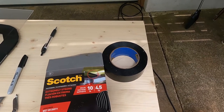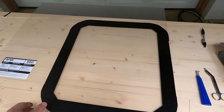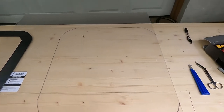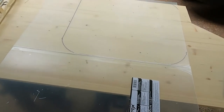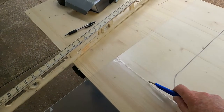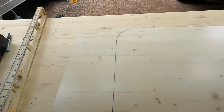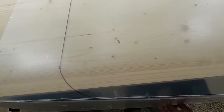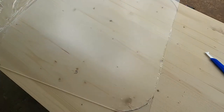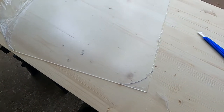And there's some duct tape — the black Gorilla tape that I'll use to outline the windows. Using my other window, I outlined it on the acrylic and now I'm going to cut it out. Essentially you score this with your knife, then you take it to an edge and it snaps and breaks in place. For the rounded ends, I scored them and then snapped them off with a pair of pliers. Works pretty well.